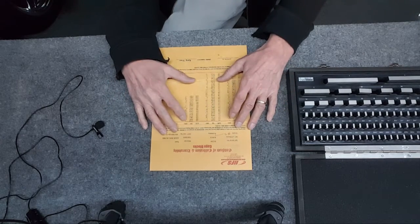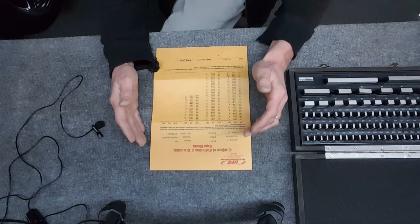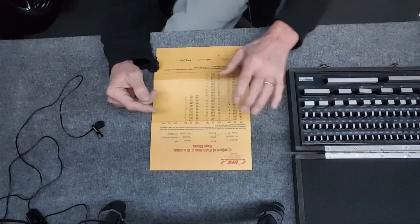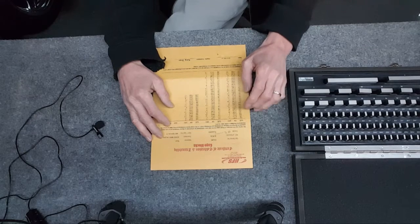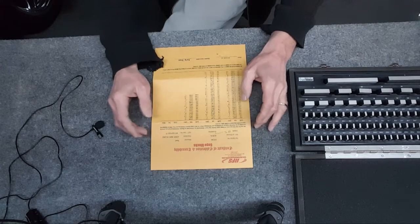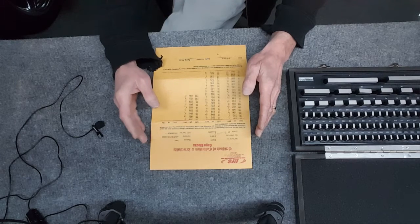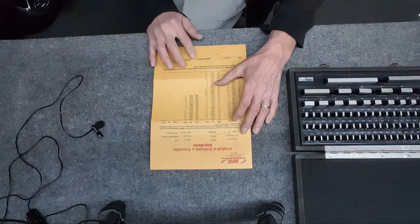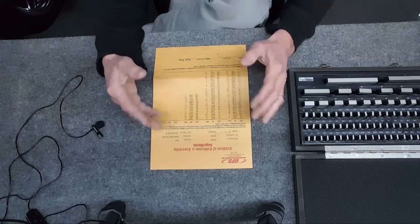So right off the bat, this certificate is bogus — it has to be, because grade B doesn't specify a sub-grade, but it's still beyond specification regardless. The only thing I can say is I did look at one entire row, and somebody is typing in the serial numbers because every block in that row does have the correct serial number listed. Every certificate I've seen from a really expensive high-quality set has handwriting on it — either a date or a signature of who the inspector was. If there's no handwriting on it, it's probably a fake certificate.